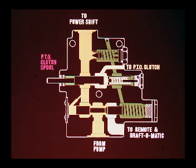As the spool is moved further into the valve body, the modulation valve spring tension increases and a corresponding clutch pressure increase occurs. When the spool is moved full stroke, the modulation valve spring pressure is high enough that there is no relief action at that point, and PTO clutch pressure regulation is accomplished by the flow divider valve spool.